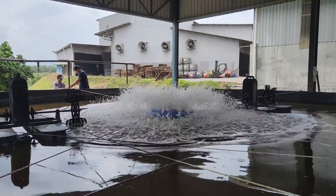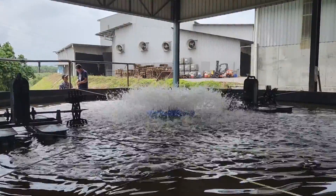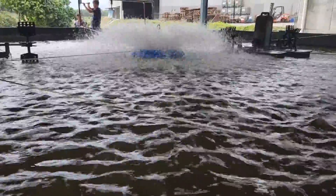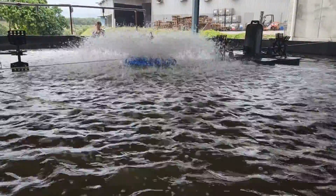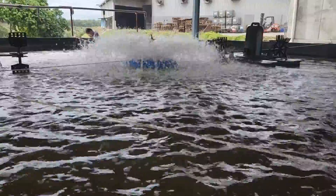Bear in mind this is a 10 meter diameter tank which can house up to 90 to 100 cubic meters depending on the depth. Once it turns on, it's able to generate a lot of waves on top and you can see water clearly moving upward from the middle to the sides of the tank, which actually scours sediments from the sides of the tank into the middle at the bottom — a bit like a teacup effect.